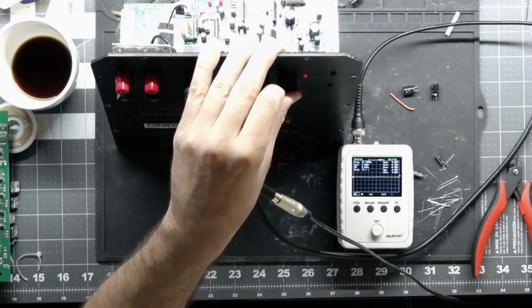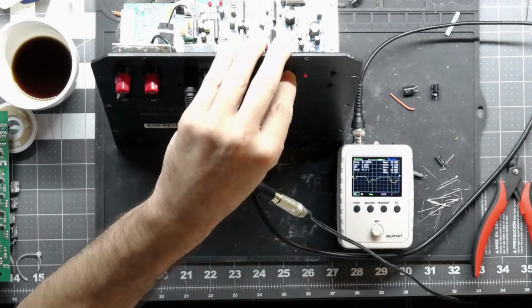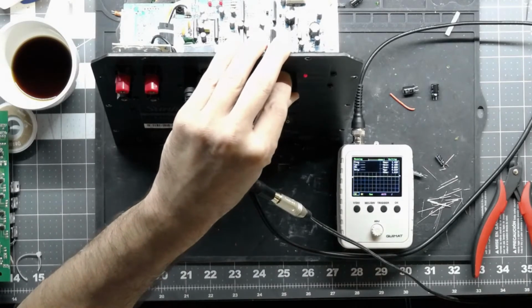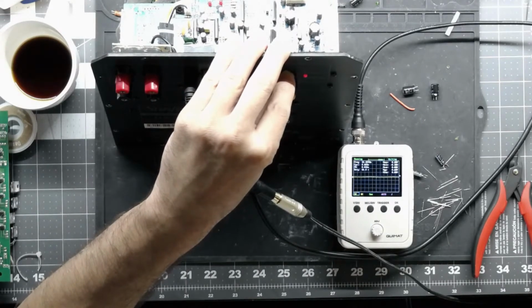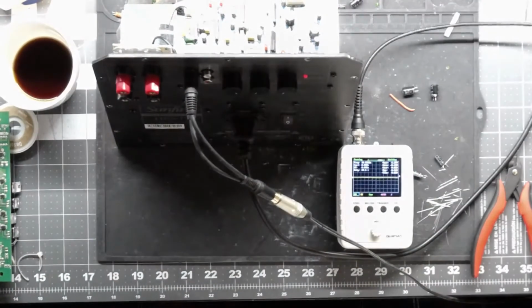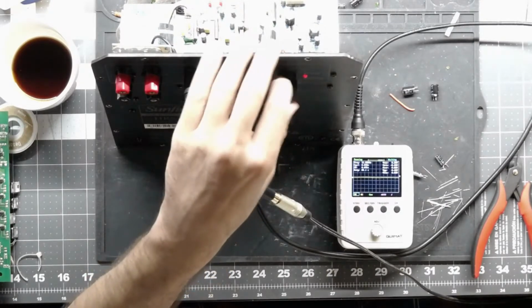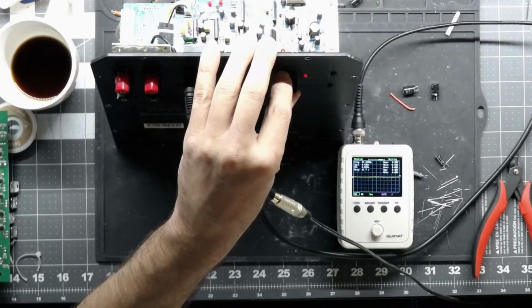And we hit current limit right away. I don't know if you guys saw that flash. The amp, my bulb is fully glowing and it's resetting the power supply. So let's go full power. Make this guy happy. It needs more than an amp to run. Now we're going to slowly crank the volume up. There it is.